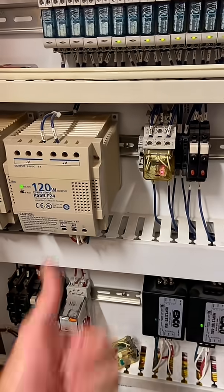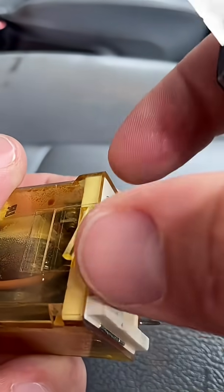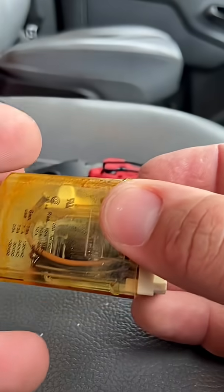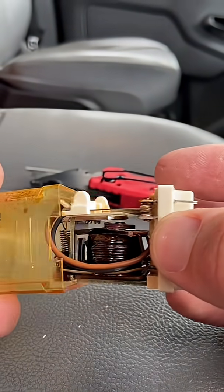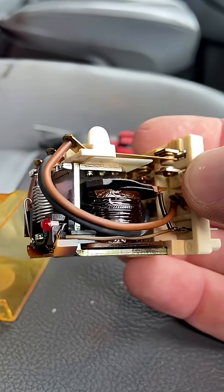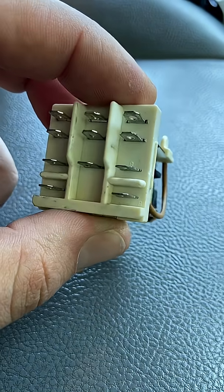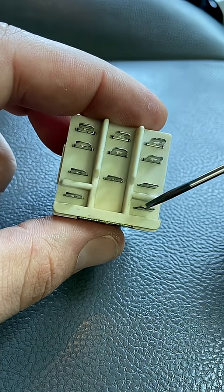That is the disadvantage of blade relays — you never get that with pin relays, even though they're old school. And there you go, another easy one done. But I got curious, so I decided to take the old relay apart. You can see it's pretty well cooked. It was actually baking the lacquer off the coil, but like I said, it was still working. While I had it apart, I figured it'd be a good time to give you guys a crappy crash course in how electromagnetic relays work.